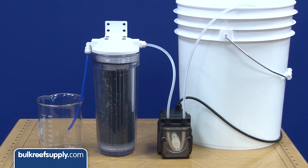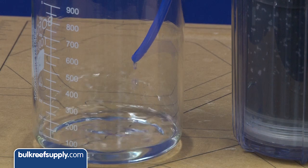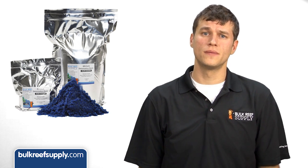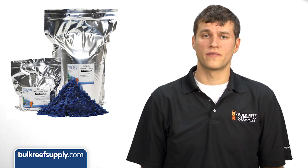You should try to limit the flow through the resin to a few gallons an hour, similar to your RO system's flow rate, for best results. To be honest, this is kind of a pain. When most people do the math on the cost of setting this up and the space and time consumed, they would prefer to just buy more resin, possibly in larger, more cost-effective sizes.